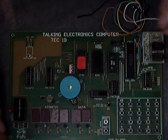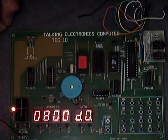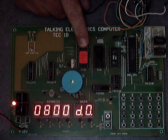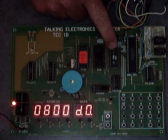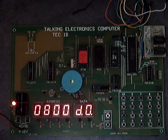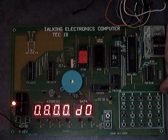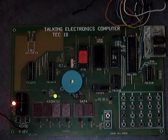Pretty basic. We'll connect up the power and see what happens — should work. Just a couple of wires off a battery there. It's got a 2K monitor which controls everything on the board, and 2K RAM, and essentially another RAM socket that's used as expansion, and a whole lot of bits of wire for other address lines and control lines that I've put on there. It's quite simple. It's got some software already in it that comes in the monitor. It plays a little tune — it's way too fast because of course it's running on a crystal oscillator.